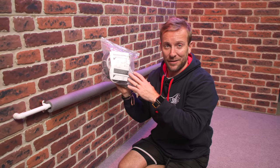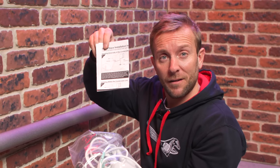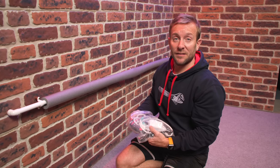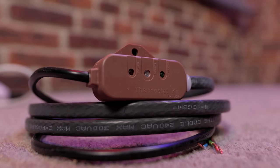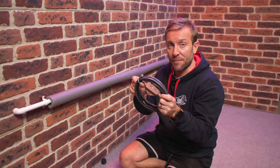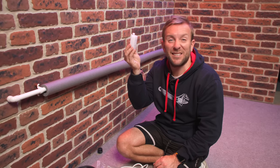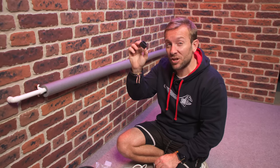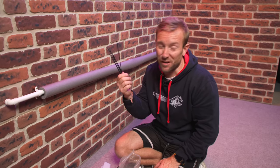I've got a boiler trace heating pack bought off Amazon, also available in our Amazon store with links in the description. In the bag we've got our instructions, our trace heating wire, and a thermostat - this little box gets screwed onto the wall outside so it can get an accurate reading of the outside air temperature. We also have a little RCD trip with reset and test button, which goes inside the house. There's a small connecting block box as well. Plus we have a bung - you can actually install the trace heating inside a larger condense pipe; if you've got an inch-and-a-quarter condense pipe, you can cut the end off, stuff the trace heating wire down the inside, and make good the end hole with this little rubber bung. The kit also includes tie wraps.